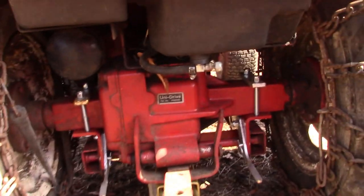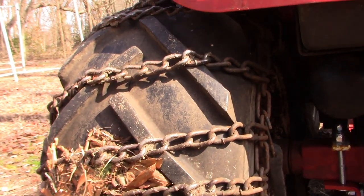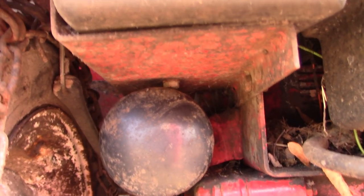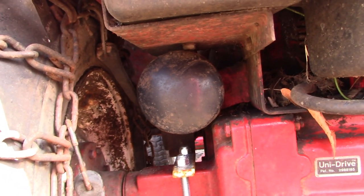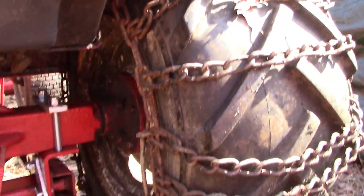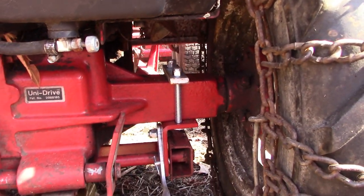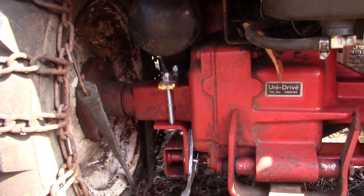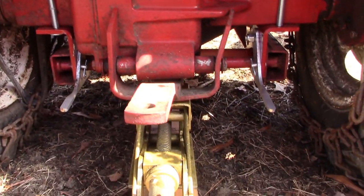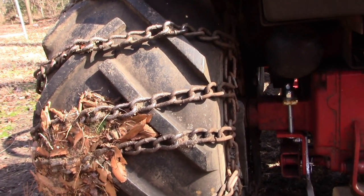The first thing I'm going to do is support the rear of the tractor with a jack, then I'm going to remove at least this wheel on the left side because that's going to give us better access to the transmission filter and also make it a little easier to video what we're doing. I might take off both wheels. I've got a bracket on the back that is part of the snow plow and I want to try to leave that in place unless it's completely in the way.